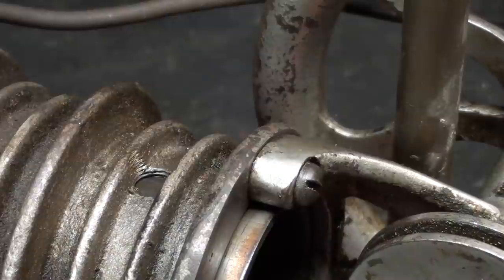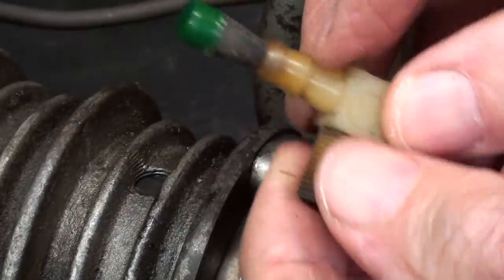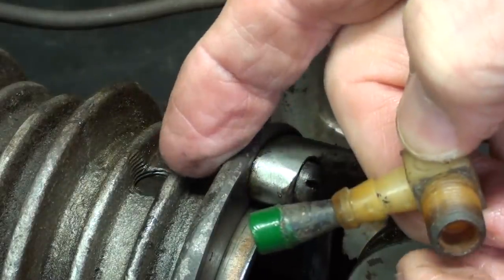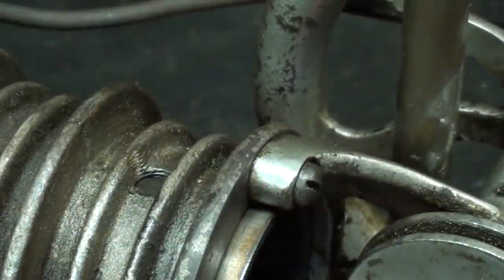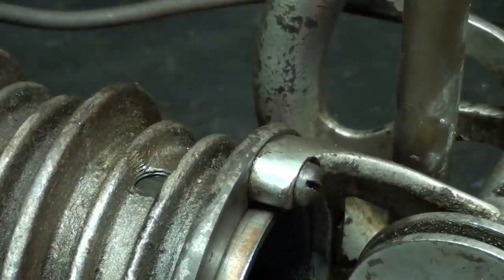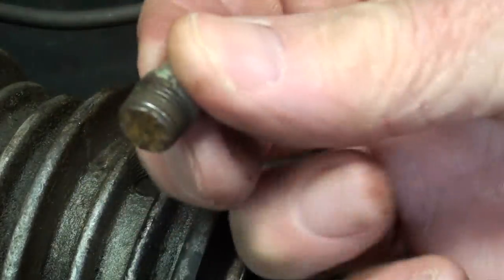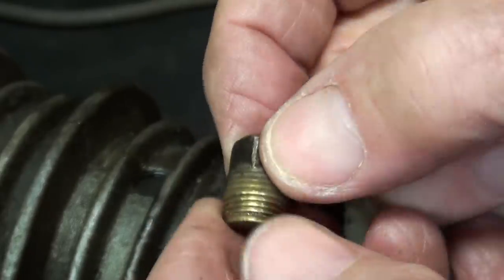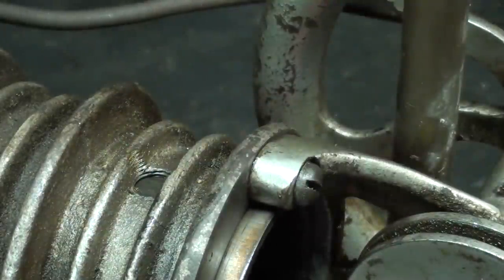I think I would like to fill that hole with some epoxy — JB Weld or something similar. I'm not going to do that just yet, but I think it needs to be done. However, I did find this little nylon fixture from a gas tank that I can use to block it while I perform some experiments. I couldn't risk cracking the casting by forcing in a pipe plug, so I tried brass first — that didn't work as well — which is why I'm using plastic. But you can see what the problem is there.